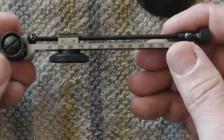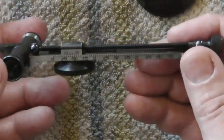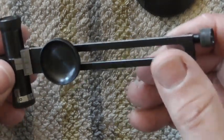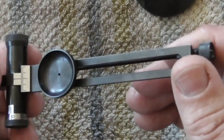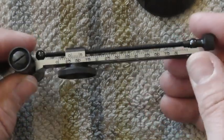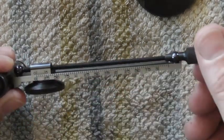MVA tells you that if you take this thing apart, you will have voided the warranty. I would love to take it apart just to see how they make it and how precisely it's finished. I seriously think that's just due to them making parts that are super, super accurate and finely finished. Being a machinist and a tool maker, I get it — and that also tells me why these things are so expensive. Things have to be matched and made per the sight so that everything adds up tolerance-wise, your tolerance stacking.